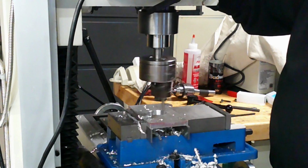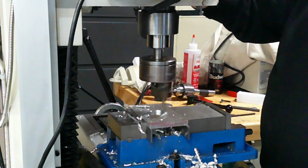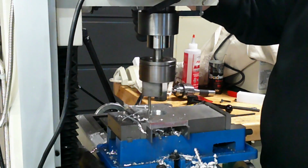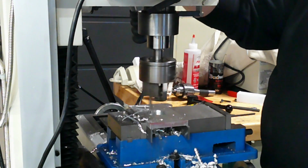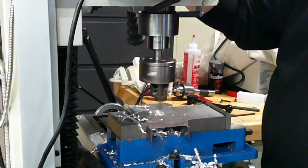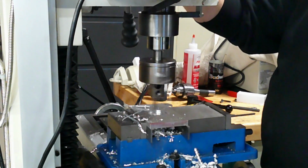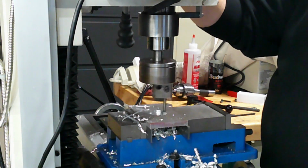As you can see, the boring head had a 3/4 inch shank on it, and it was in good shape. The adjustment was accomplished by loosening the screw and then turning the dial screw, which had a vernier scale of 40 thousandths for one revolution. It was not real accurate, but within a few thousandths, and seeing how the hole I was boring was for clearance only, I accepted the issue and the results.